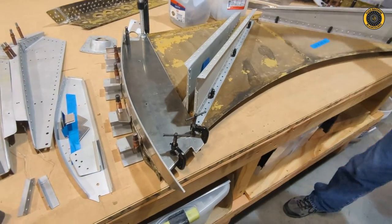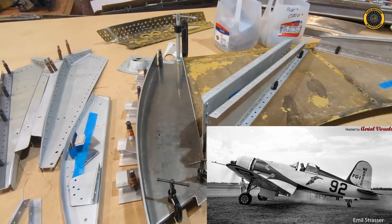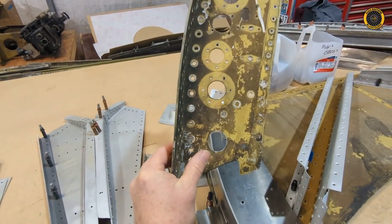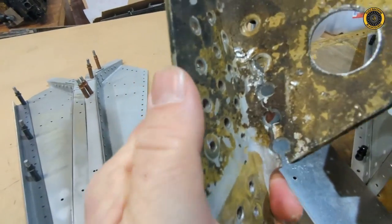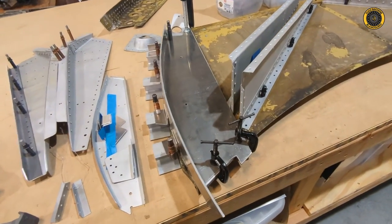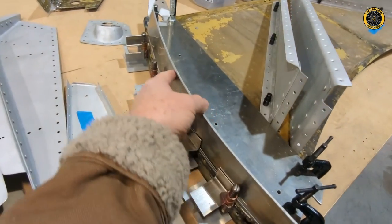Here's an example of some of the sheet metal work going on. This piece mounts right behind the firewall on Lucky Gallon, a racing Corsair from back in the 40s. This is the original piece. This is where the engine mounts, right through this hole where my thumb is — look at that, worn out, cracked, and busted right through these rivets. So they've got to form a whole new piece using a huge press and thick dead soft aluminum to hammer this curved piece into shape.